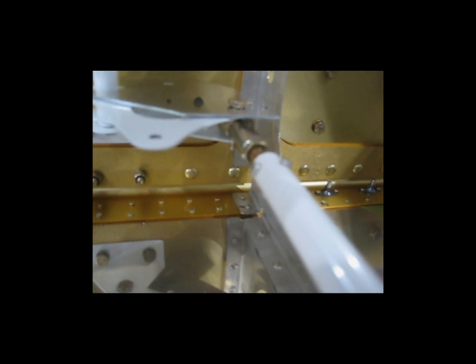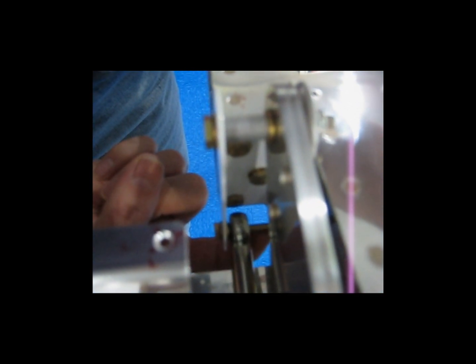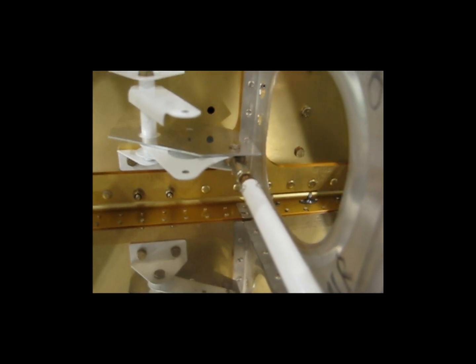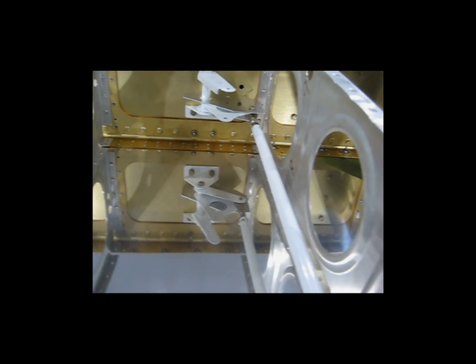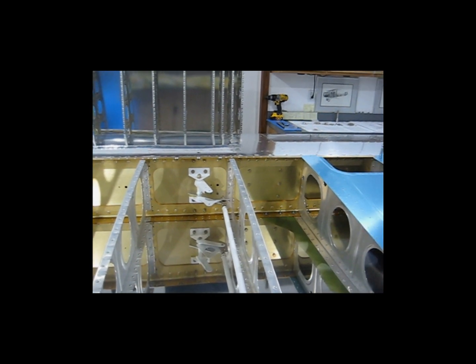You can see I've got mine adjusted for length and I've got the jam nuts on. You can see how much play I have in there — it's free to roam, and it's the same on this end as well. I still need to make my mechanical stop. But even so, the ball end still has movement. If this ball end was cocked in one direction and this rod end was cocked in the opposite direction, this tube would not be free to rotate. So just make sure those rod ends are perpendicular to each other and you'll have good movement so it can do what it needs to do when it's traversing in and out. Let me move on to the main push-pull tube coming in from the fuselage and we'll continue on.